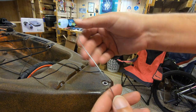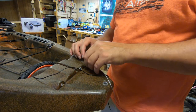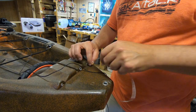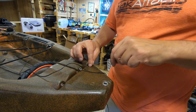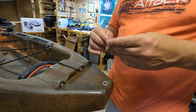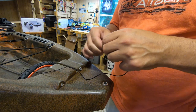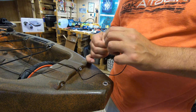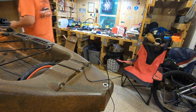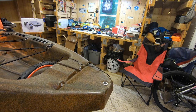Here we're installing the rudder cables. The Yellowfin 120 is rudder-ready so all of these tubes and ports are set up and ready to go. One tip I have is to use a piece of wire with a little more rigidity to thread the rudder cables through. The rudder cables being a little soft will kind of back up in the tube as you're running them through. Get something more stiff like a wire - this is decorative picture hanging wire - run it through, twist it up on the line, pull it through and you're good to go.